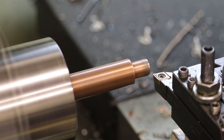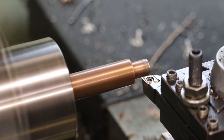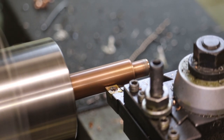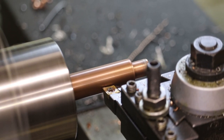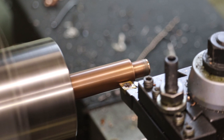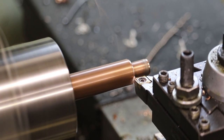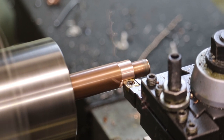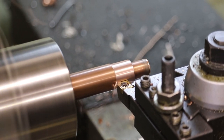So we'll set Z absolute. Switch to millimeters. Then we'll see where 43 millimeters is on this guy. We might have to do a few steps because otherwise our electrode is gonna flop around because we're extending too far out from supported stock. So yeah, we're gonna kind of do some cone cutting here. Let's get to at least close to where we want to be.